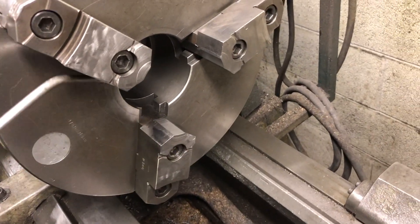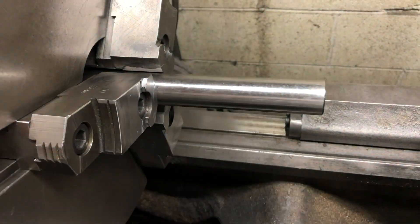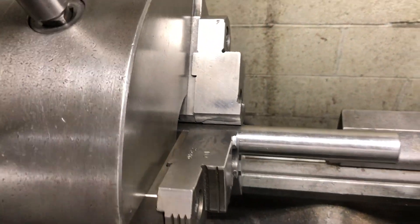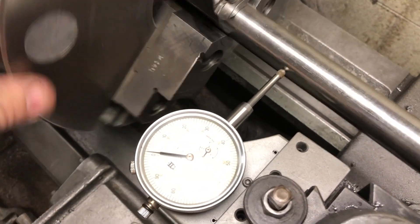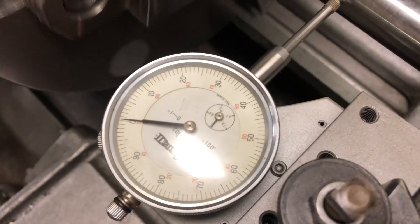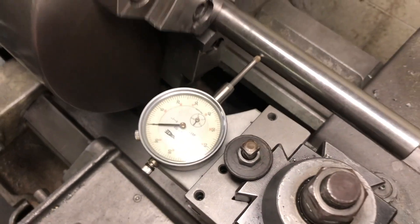After some slight and non-invasive cleanup, it's time to take a measurement of the aftermath. It's certainly not perfect, which I attribute to the wear of the chuck itself and the difference between jaw location while grinding and clamping of the test piece. But it is definitely an improvement — one thousandth.